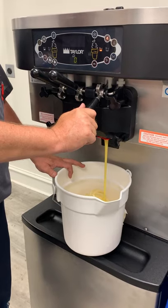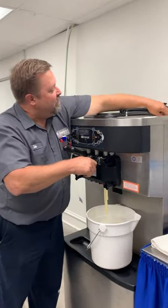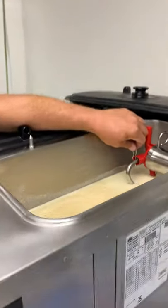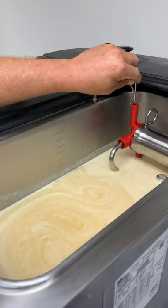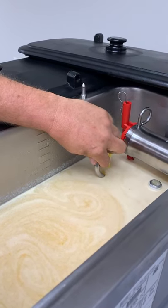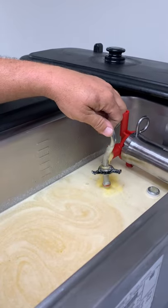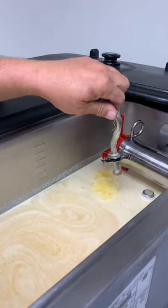So now we're down to pure liquid. Now that we've relieved the pressure in the barrel, it's safe to remove the pin out of the feed tube. Push that pin right in there just for safe keeping, and slowly pull this out. If we don't relieve the pressure on the barrel first, this will actually shoot to the ceiling and cause a huge mess.